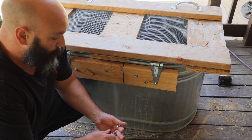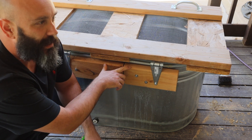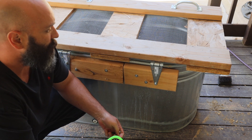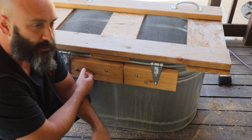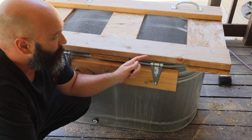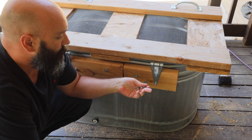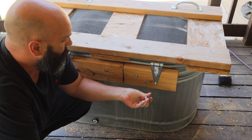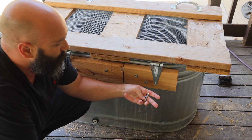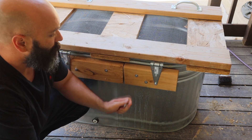Here's what we got. I used upcycled, recycled wood — just leftover pieces from a separate project. Probably would have been better to use one long piece, but these two pieces worked. I used pan head screws on the inside to go from the bracket into the lid — one-and-a-quarter pan heads, Phillips. And on the backside I used hex head one-and-a-half inch screws so they didn't go too far into the wood.